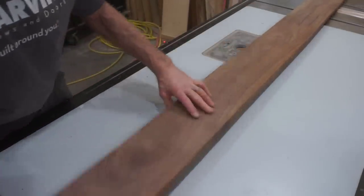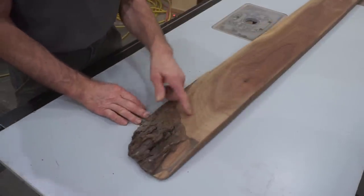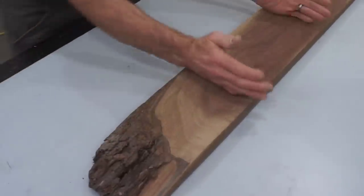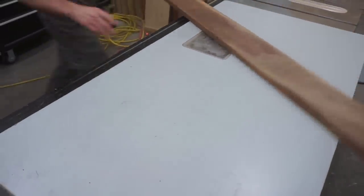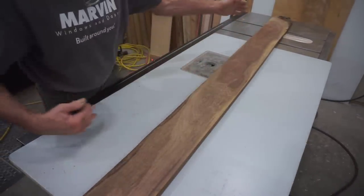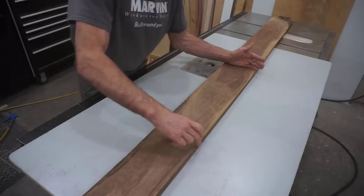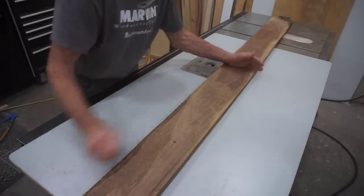as it rocks on the saw top. There's some wane on this end with this bark. This is a pretty grain structure. I'm hoping I can preserve that in one of the pencil faces. The other end of the board has bark or wane on the opposite corner. So I'll cut this in half and then rip 2 strips starting from this side to trim as much of that bark off ahead of time.